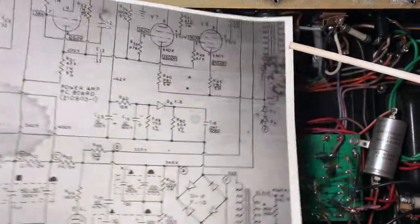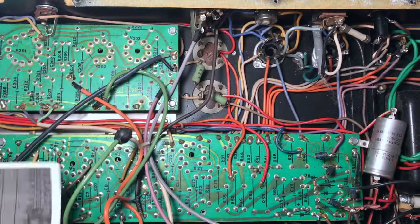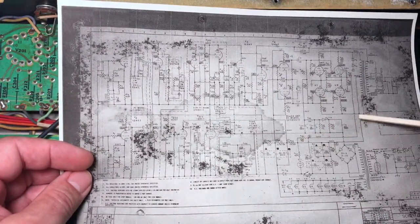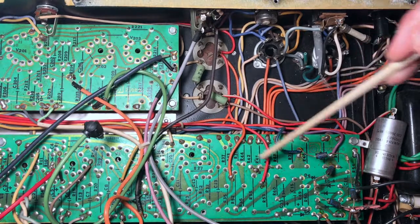You follow it up here. Ran out of schematic there, but if you follow it, and this schematic, no, it's not that schematic either. The full schematic, thank you. If we take the full schematic and go from that B node and follow it up, we see that it's supplying all of the screen resistors, which are somewhere around here in the circuit.